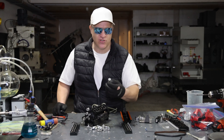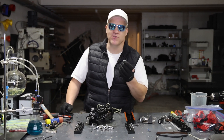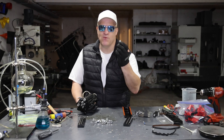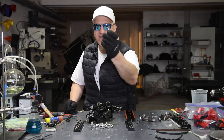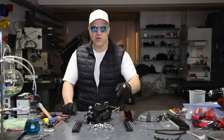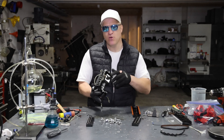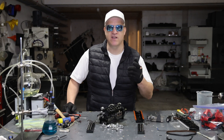I feel like they tried to do a full-size engine design in this small engine with the piston rings, but some things just don't scale down very well, and piston rings are one of them. If you want to see how piston rings work, check out a channel called New Mind — I'll put a link in the description. He went into the science of how piston rings work, and comparing that science to how these piston rings are working here, I don't think they're doing a very good job — that rubber O-ring is doing most of the work. I'm going to try to come up with a better design for this and a better head gasket. Whoever machined this engine did a great job; whoever designed it, maybe not so much.